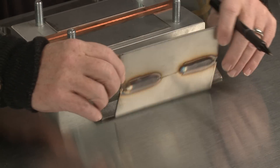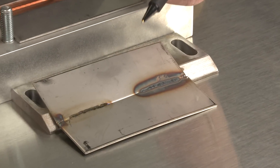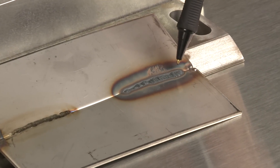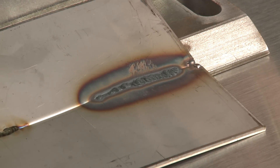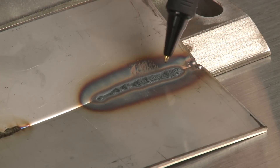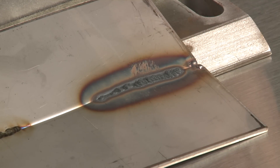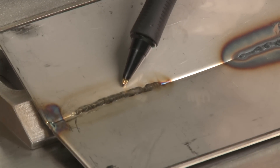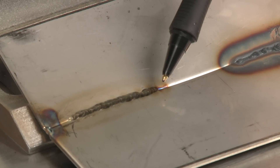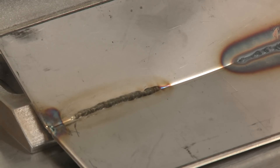Now I'm going to turn the part over — and this really is the telltale sign of whether you did it properly or not. This was the oxide — sometimes you hear it described as brown sugar. The backside did not wet out well at all, so that'd be non-fusion. Because you have these chromium oxides, cracks are going to start forming and you're going to have poor performance in your part, whatever you're welding — an exhaust system or anything else. But this side, with purging, has perfect fusion. You can see it wetted out very nicely. There are all kinds of ways of purging, and we're going to continue those in sections two and three.